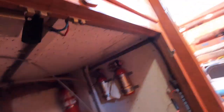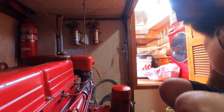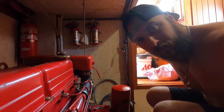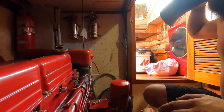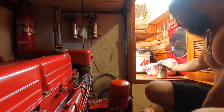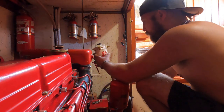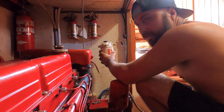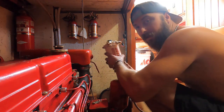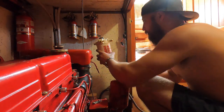I'm going to mount this on the bulkhead. Let's see if I can hang this thing. I think that works. It's dark on the camera because it's dark in here. For me, a lot of people put filters in weird spots, which is kind of a pet peeve of mine — because every time I've had to change a filter, it's usually when it's clogged. If you mount a filter, put it in a place you can reach, man.